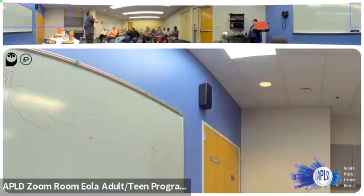Here, go ahead. I just want to suggest for that, since I did it myself, don't be in a hurry when you change the filter, when you take off the wrap. What happened to me last winter is that paper that sticks, kind of like magnetic, stuck in there. I didn't know it was still in there, and it almost blew my blower up. I had this noise. My husband said it's all in your head, there's nothing wrong, but it would have blown our blower up. So make sure all the paper is out of there before you stick it in. Don't be in a hurry.